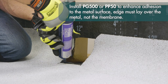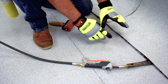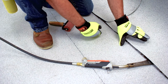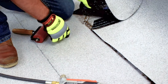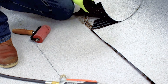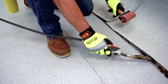The bead of PG500 will help ensure water tightness. Now we're going to continue to hang this wall flashing to complete this detail, but there are a couple of things you need to know. Anytime you're going over a granule transition, you need to make sure that you add heat or adhesive at that over-granule area. In this case we're going to use a hot air welder. You'll also need to make a 45 degree cut to soften the transition at the side lap, then pull the release film and roll it in, adding additional pressure to make sure it properly adheres.